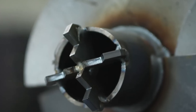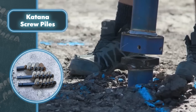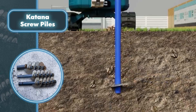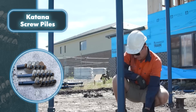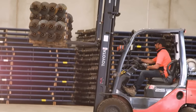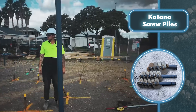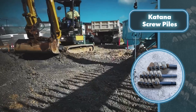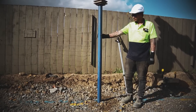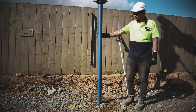Katana Screw Piles: when it comes to foundations, steel screw piles provide a faster and more cost-effective alternative to conventional concrete bored piles. Katana recognizes the demand for this method in the current construction industry and focuses on manufacturing these piles. This type of pile has an undeniable advantage over concrete piles in terms of installation speed — building with concrete piles takes significantly longer because you need to bore the ground in advance, whereas steel screwed piles are simply screwed in without any preparation. Additionally, a considerable amount of time normally spent cleaning up after drilling for concrete piles is eliminated. Katana's steel screwed piles are used in foundations of residential buildings, light commercial buildings, and in the mining industry.